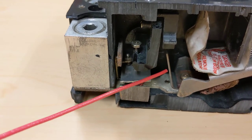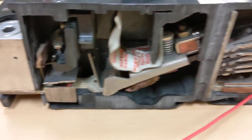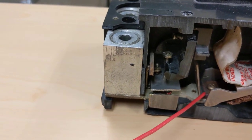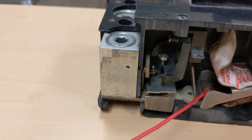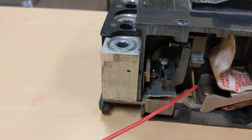This element is made out of two dissimilar metals. When current for the circuit flows through from this side through the movable contact, that bi-metallic element is in series with this bus, so all the current for the circuit flows through that bi-metallic element and causes it to heat up.